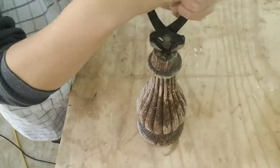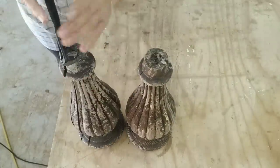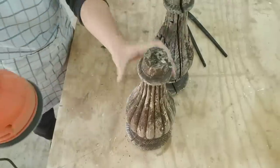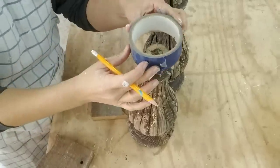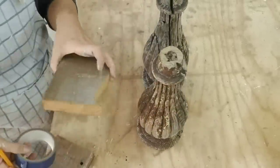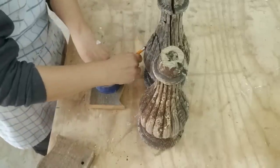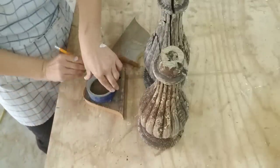For this project I first need to remove the plastic hardware on the piece, then I'm going to sand the top with my orbital sander to get a flat surface. Then I'm going to look around my shop for something round that feels like the right size for the piece and use that as a guide to cut a circle. I have leftover thick pieces of cypress from the breadboards I make — a nice-sized cut-off — and I always keep pieces like that in case I need them later.